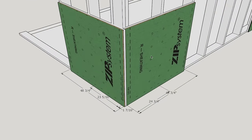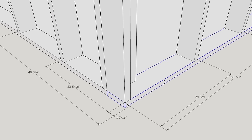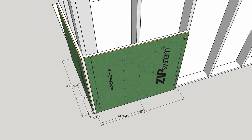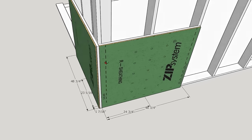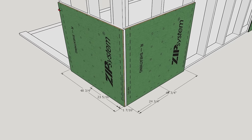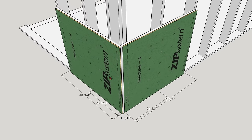Let's go over layout if you're using the Zip R Sheathing. In our case, we were using the Zip R6, which is a one-inch poly ISO bonded to a 7/16 panel, making a total thickness of one inch and 7/16. Normally we would lay out right from the corner of framing, going east-west and north-south. I want to fully cover this end stud with my panel and center over it. Notice that I fully cover the end stud and I'm centered on that stud at four feet. With the thickness of these panels, I need to lay out from the outside of the panel and then center my stud at four feet — so all that means is I burn an inch and seven sixteenths and then lay out as normal.